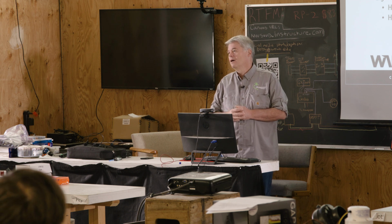I'm sorry. You want to err on the high side, like everything in the world. You don't want to be running them at 90% or 100% of their capacity. Try to oversize, go one size bigger. That's how I've gotten through. On my anchor windlass, for example, I actually went two sizes bigger, and I sleep well at night. So do the same thing when sizing, okay?